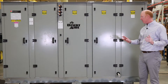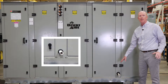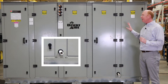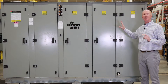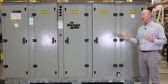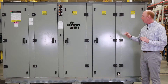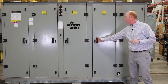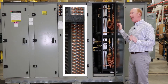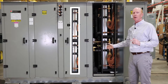Moving on down the line — the condensate drain is here, and it also has the option of being on the right side, left side, or coming out the bottom. This unit can be indoor or outdoor, and the units can be water cooled or air cooled. This particular unit is air cooled. Next downstream from the air filters are the evaporator coil, tucked in here, and then you've got the full-sized hot gas reheat coil.